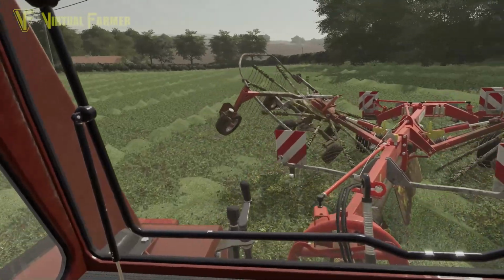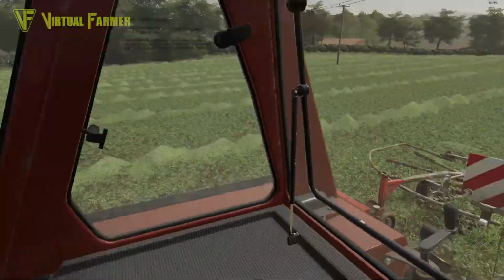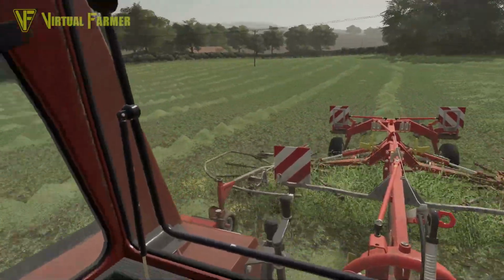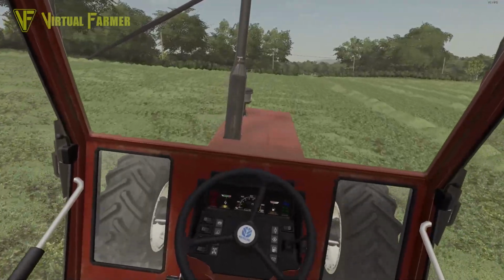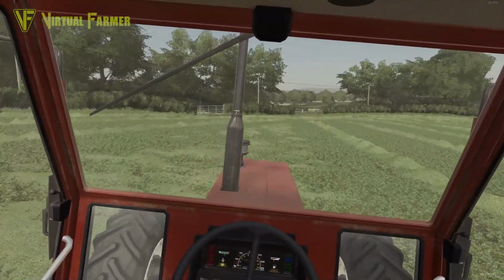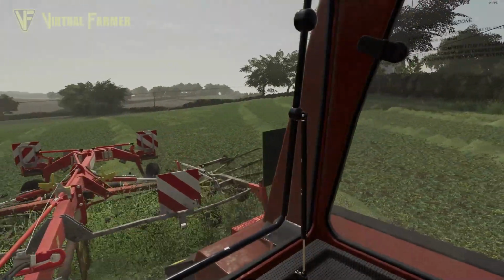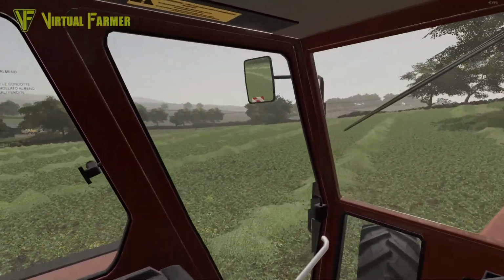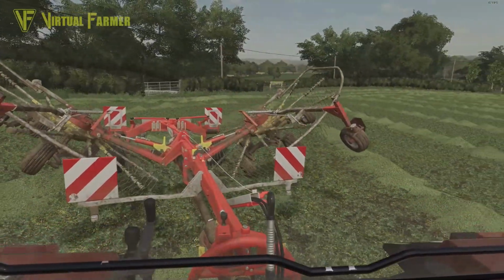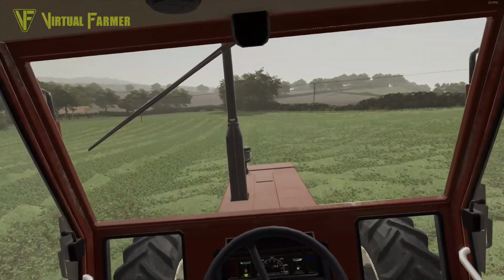Here we are. Let's get... Ooh, that. This windrower does not reverse easily. Not at all. It's got a rear turning axle to allow you to get some really sharp turns in at the ends. But the downside of that is that as soon as you reverse it, those rear wheels start turning sharper and sharper. The more you turn in reverse, the more it starts going to the side, so you just lose it really easily with this in reverse, which makes it fun to park, of course, as well.